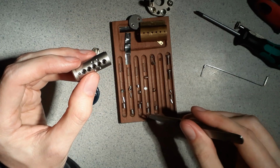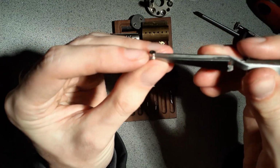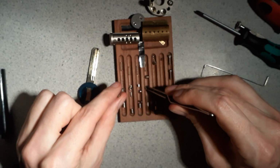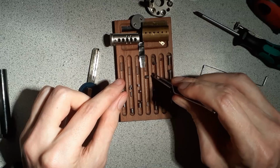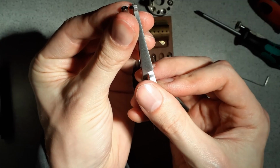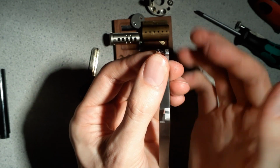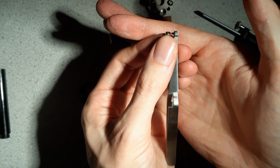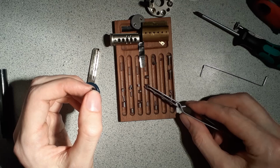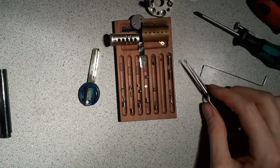Let's look at the tops of these key pins. And yeah, you see they've got a bit of a taper on them, which I believe matches up quite well with the not master, but trap wafers. So they're just the little chamfer on the edge there. I don't know if that's going to show up at all, but they look similar enough that I would guess that that's the orientation that the wafers are meant to go. But also I haven't really determined if it makes any difference to how much it traps.